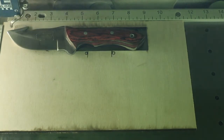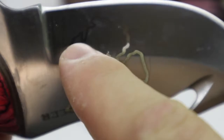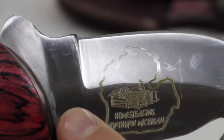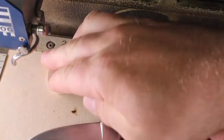The etching is done. See how it's really dark down here and lighter further up — almost like a polish. If you wanted it even darker you could slow the speed down to 30% and it would come out nearly black, but you'd really feel the depth. Now let's try to get it to a true black.